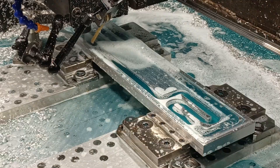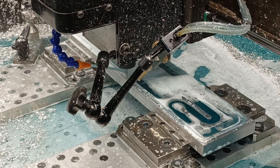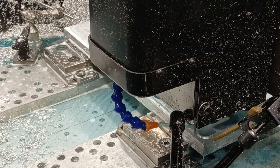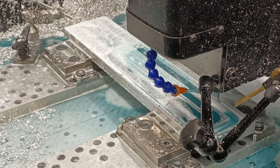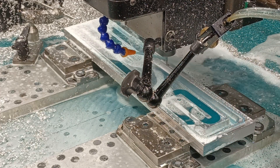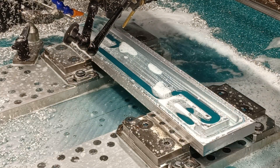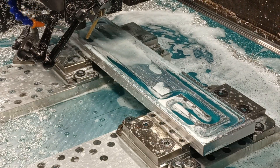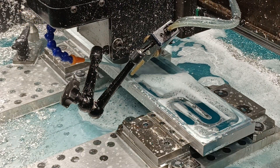It's crazy - we're removing such a small amount of material but this program is going to be longer than when we hogged out those big slots and removed a ton of material. Some things you just can't do without more RPMs - I can't go any faster. If I had a 15,000 or 16,000 RPM spindle I could move quite a bit faster. Right now we're at 64 inches per minute - if I had 16,000 RPM instead of 8,000 I could double my feed rate, because the chip can only be so big. If you spin faster, you can move faster.